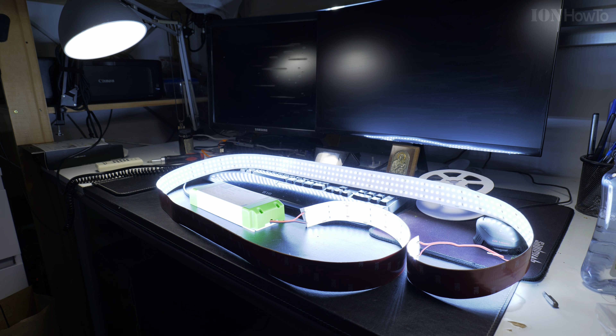Installing the cover — the cover is pretty nice actually on this model. Many of these LED driver units are pretty much bare. I understand they're meant to be installed in kitchen cabinets or other enclosures, but some of those have exposed live AC terminals. This one doesn't — so that's a pretty good thing. The DC side is much lower voltage, a lot less danger, but you still shouldn't short the wires because you don't want to short the LED driver.